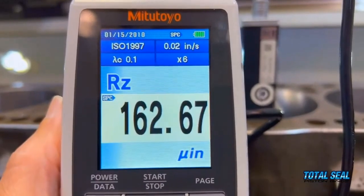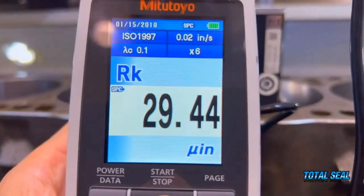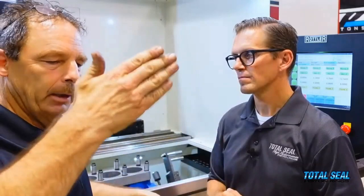With the diamond, you go completely within a tenth of a thousandth of finished size, then go to your 600 CBN finishing plateau stone — you're really not taking any extra material off. In the old days, people would step down maybe a thousandth or two, then two or three tenths with each stone. But as you go, you're doing away with your valley. When you measure with a profilometer, we're looking at plus or minus 100 microinches — that's a tenth of a thousandth. If you progressively step through grits, you've completely done away with your valleys through many thousandths of work.